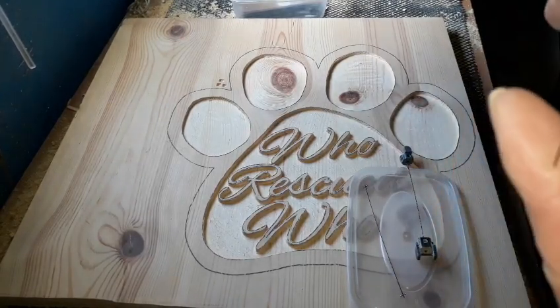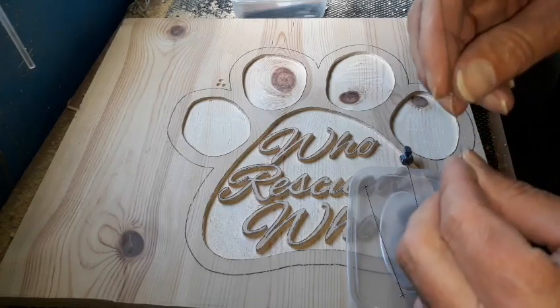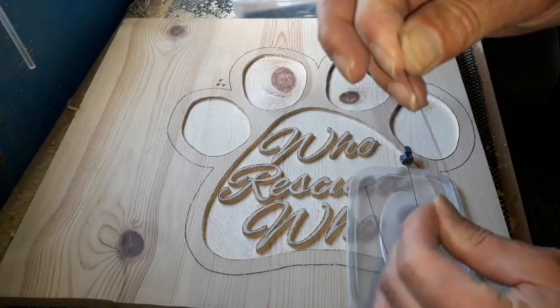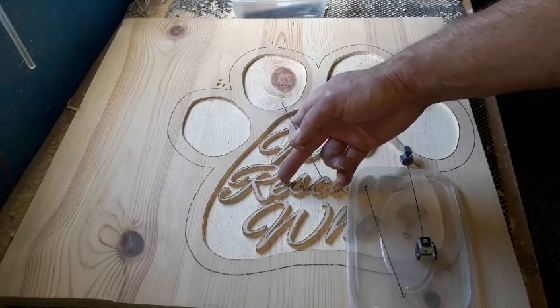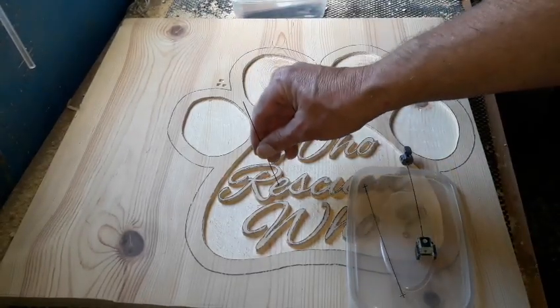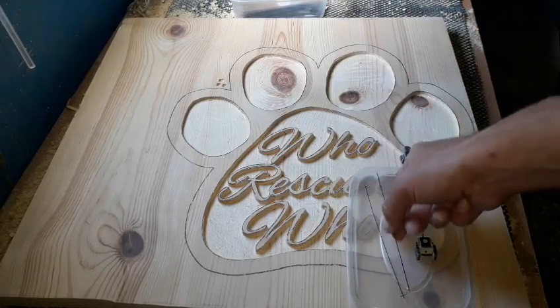Obviously, it's pinless, like so. And they fit into the more fancier and more updated saws. And it's literally a clamp there, squeeze it together, take up your tension again. Same blade at the front, smooth on the way down, rough on the way up. And you'll drill yourself a little pilot hole. I mean, you can see how small that is. And that will slot in there nicely. And this allows you to do more intricate, detailed cutting.